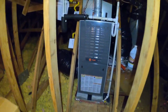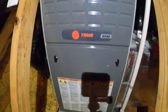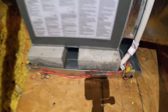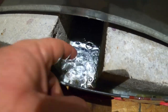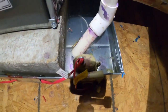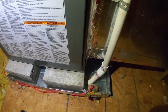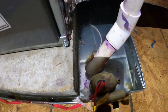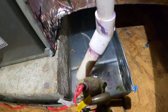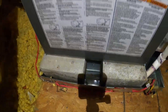We're up in the attic — have a Trane XV80 furnace. The drain pan has some water in it. This is causing the Nest thermostat to show no voltage. We've got these float switch blocks in here, so this pan actually fills up pretty quick. It looks like there's a lot of water but there's not — probably a couple gallons, two to three gallons — but we'll get that out.